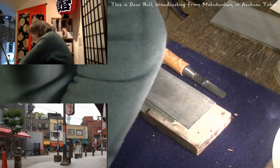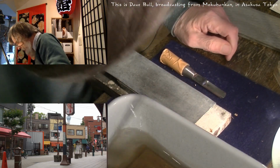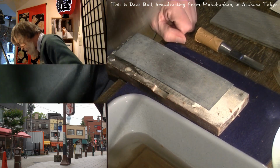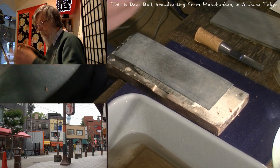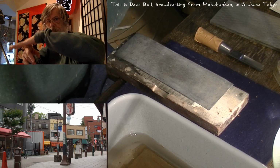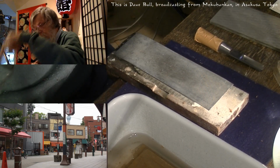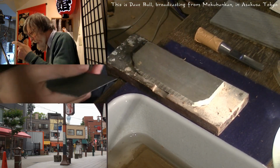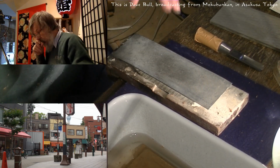But this stone is a man-made stone, which means of course it needs moistening, but it really needs moistening. It lives underwater. In my normal carving bench in Ome, I've got my wooden bucket by the side, and on top of the wooden bucket there's a little trestle where you do the sharpening, forward or back, whichever way. And the stones live in the bucket. You can't put a natural stone underwater and leave it there. You come back in the morning and you've just got mud. It just absorbs the water and dissolves into mud.